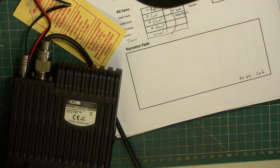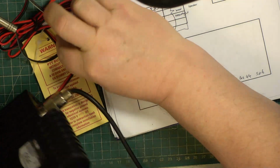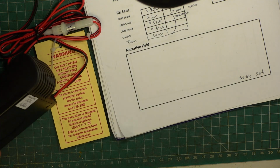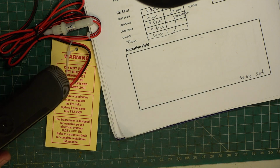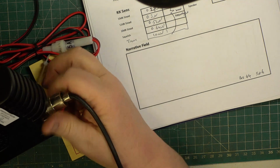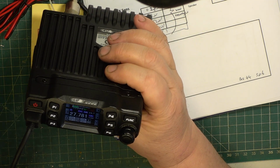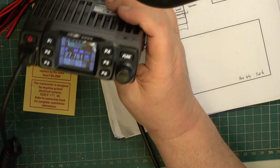Right, we'll take that off and we'll turn the test set off and we will swap to the aerial, which people continue to carry on asking about. It's an Antron 99 type. It may be a Solarcon 99, but it's that kind of fiberglass 18-foot aerial mounted just above gutter level of a single story building. It's a good greeting, isn't it?